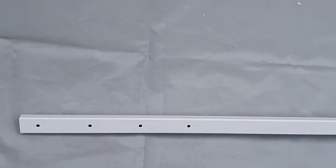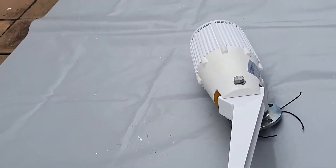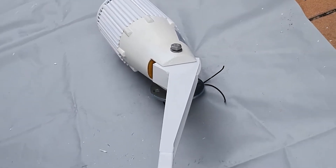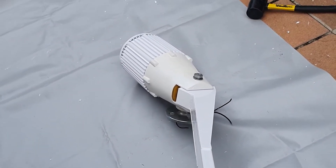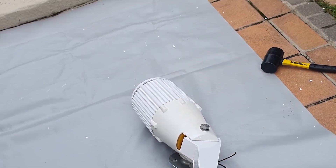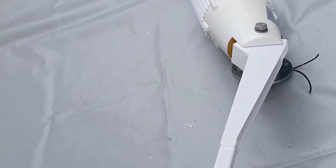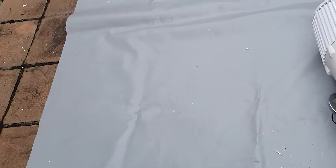I'm going to lift this up so you can see what's happening. When the wind blows very strongly it will bend the turbine around the mast and this gives the tail the ability to move out the way. If you do it the other way around the tail keeps fighting the wind and keeps the turbine into the wind. So it needs to be able to move like this away from the pole — away from the pole side, in other words to the heavy side.